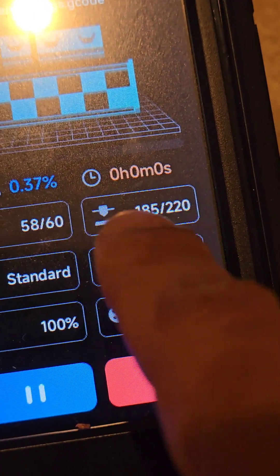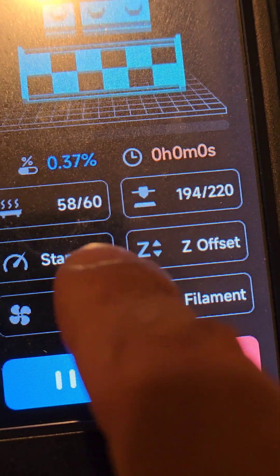It's supposed to be about 200 for the heat, so it's heating up the PLA right now. So what I did was I just took all the eccentric nuts, loosened them up, and now I'm re-tightening them. According to the directions you want to tighten them so they just touch the rail. It says in their directions that over-tightening may lead to wearing out the bearings and shorten the life of the printer.